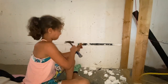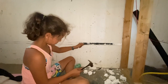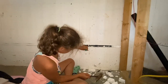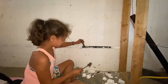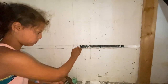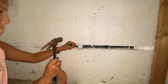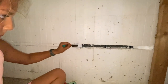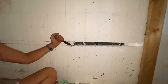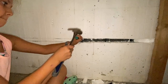Ruth is chiseling out a little trench here in the Fox Block where we will put conduit. The conduit provides a path to easily pull wire in the future if necessary, and it's where the wire will run from whatever main or junction box to the outlet at the final destination. Anywhere we have wires in Fox Block, we have to chisel this out to put the conduit in.